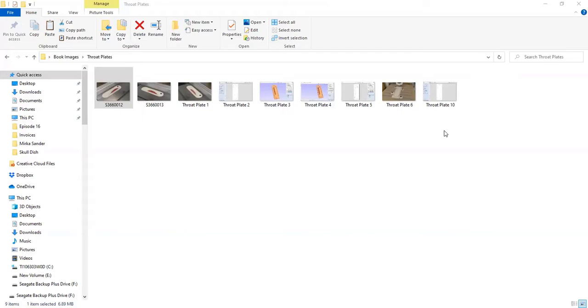And with the software, this is VCarve, you also get the ability to see a preview of what your machine is actually going to cut. So in this case, I've cut out a pocket underneath the throat plate for both. I can use this as a zero clearance insert for a standard 10-inch saw blade or for a dado stack. So I could literally make these up ahead of time and then use them for whichever I want, or I can create the individual programs to make either one of those. It gives me the ability to do that.